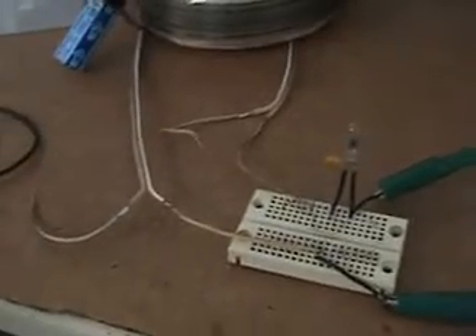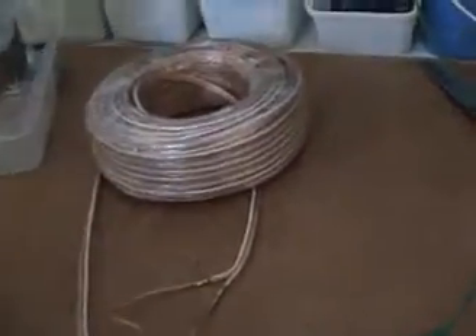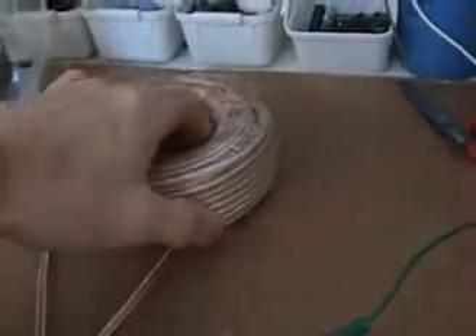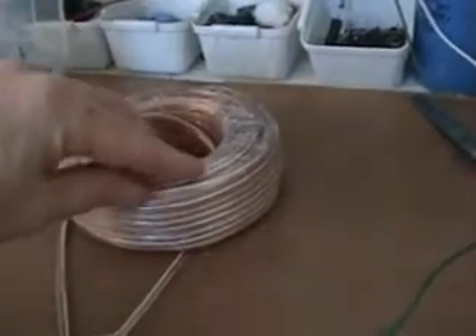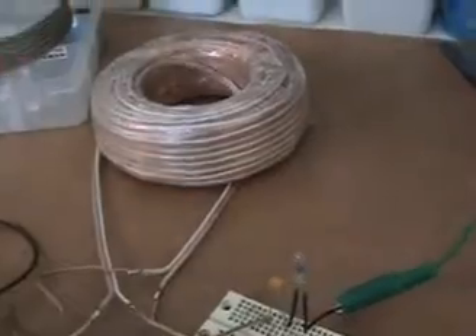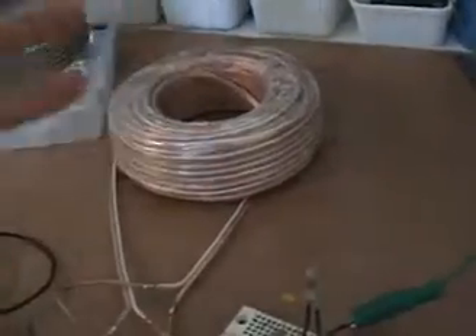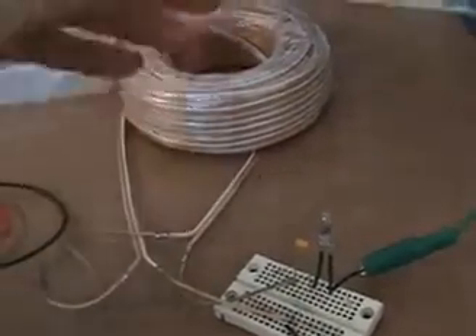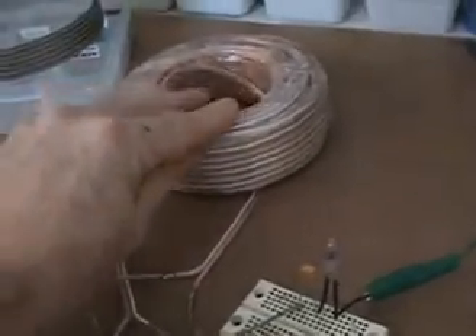My next steps: I'm going to take apart this coil, which is basically off-the-shelf as it was wound. I'll be trying to see if coil geometry has any effect on improving the output. I'll be winding it as a pancake coil, a single-layer coil, and multi-layer configurations — trying different geometries using the same length of wire to see if coil geometry has importance when using resonance.